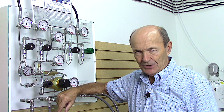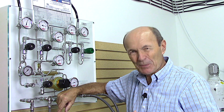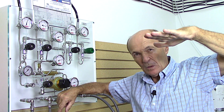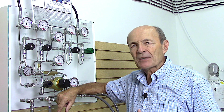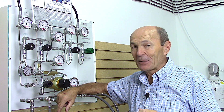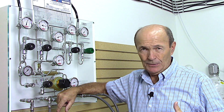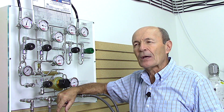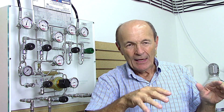First of all, what is a fill station? You have a compressor that compresses air - that's over there somewhere - and you have storage bottles into which the compressor puts the air. Big bottles, big scuba tanks, just tall - not portable, you can't wear them on your back. About 450 cubic feet each, they weigh 125 pounds each. They're storage tanks. We have about 30 of them - a very large storage bank. Those storage cylinders are arranged into groups called cascades. There are actually four groups, but essentially two at high pressure and one at lower pressure.